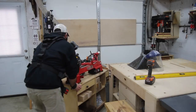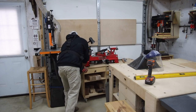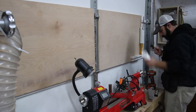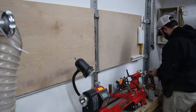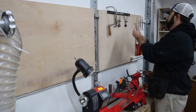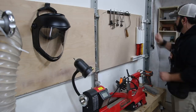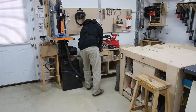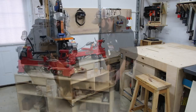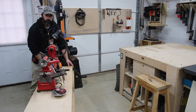Now that the boards are hanging up and the other parts of the cleats are on the back of the lathe cart, I can start loading up my boards. There's another part to French cleats I want to mention — usually you want something on the bottom side of whatever you're hanging to give equal distance off the wall from top to bottom. With the garage door you have different panels, so just make sure your plywood is long enough to reach the next panel and it should give you equal spacing from top to bottom, just as if you were adding a spacer.